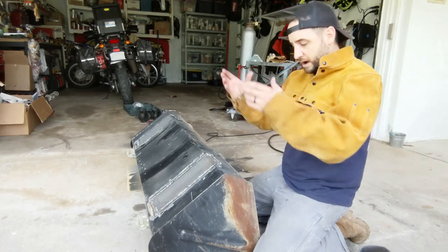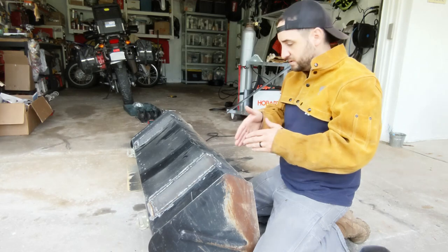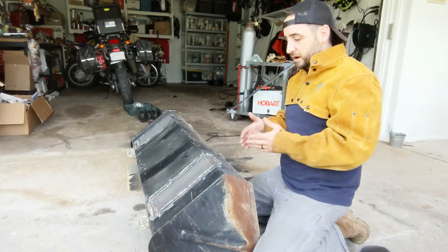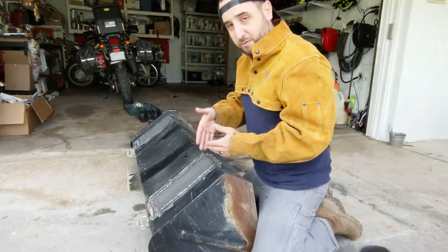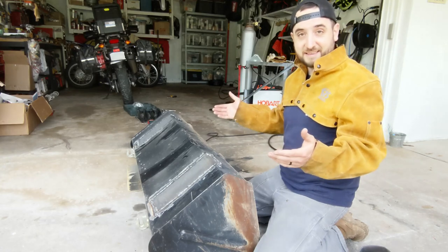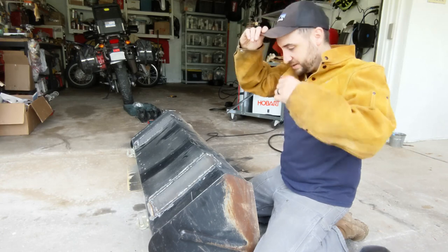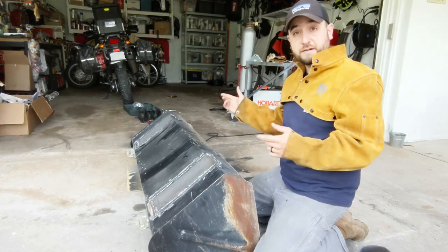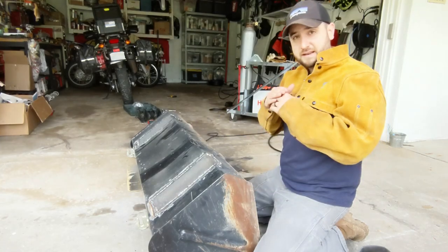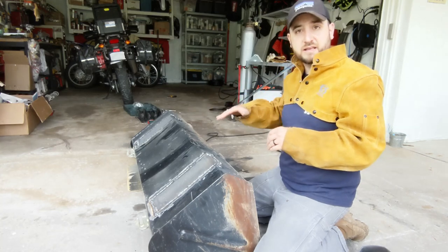So I took it off. As you saw earlier, there's two methods to do that. They're both kind of the same at the end of the day. And the one side where I had more deep cuts, I'm just welding it all anyway. So even this part is really the same at the end of the day. It's not complex stuff. So now what we're going to do is take a flap wheel on a grinder and go over all these spots again, get it nice and even and flat and prepped. And then I'm also going to grind paint at this point too.